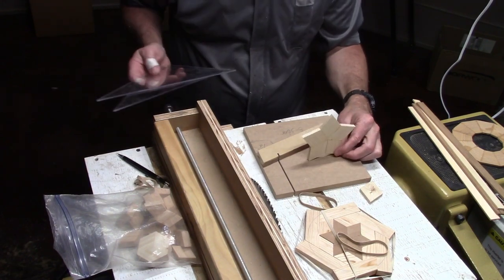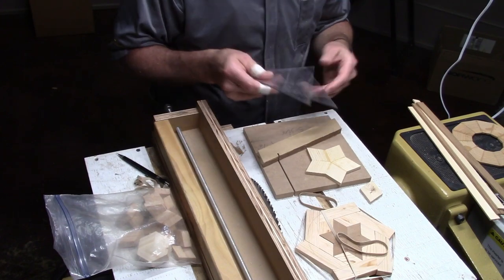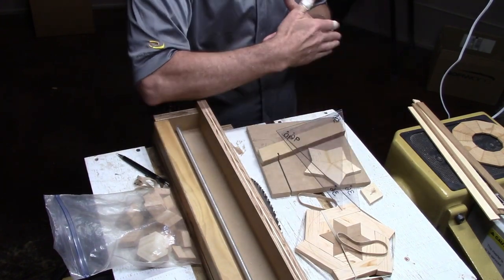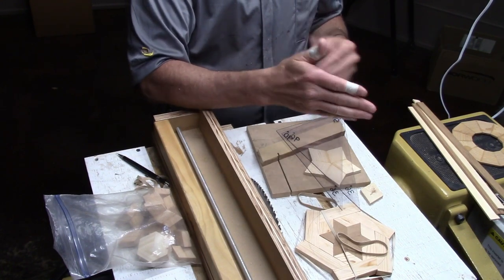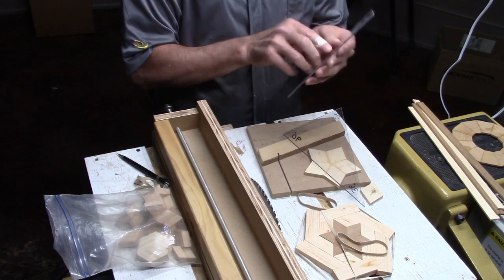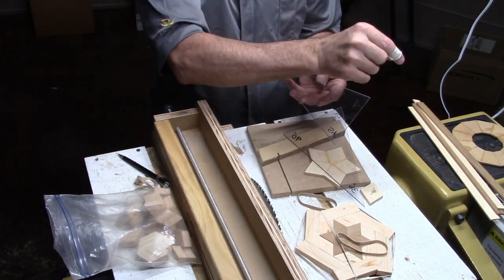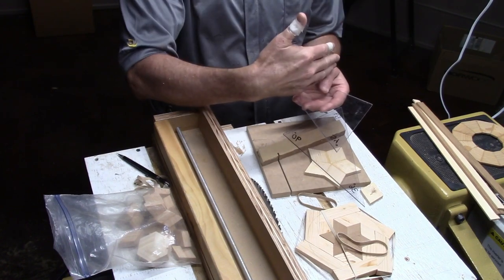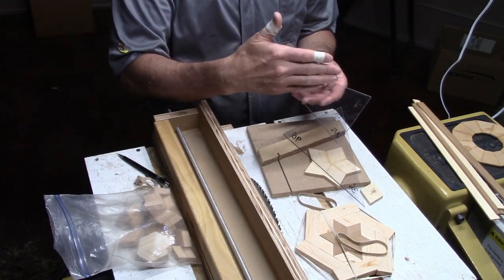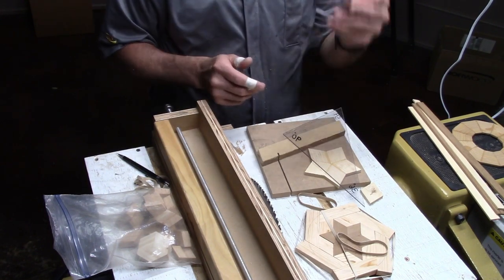How did you cut those, Jim? The plexiglass. Okay, I have a sled with a swinging arm, and I have 10 pieces of plywood approximately this size. And I cut those 10, put them in a circle, measure the gap, adjust my arm, cut them again, and I continue doing that until I have no gap. Then I lock that position and I cut these.